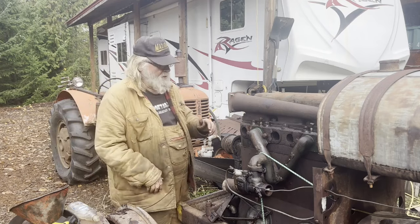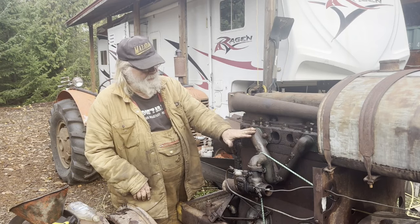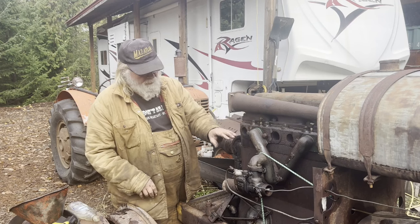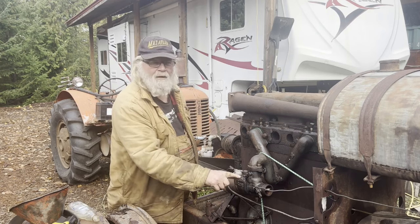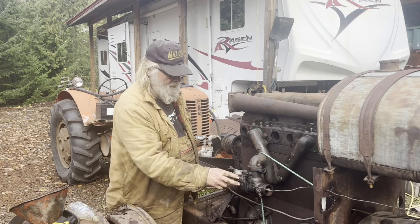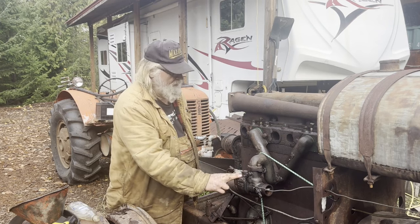Brake, that's pretty clear that we got fire in the hole. It'll run as long as I put the raw gas in through these ports. It did fire off as I choked it initially, but I think something's plugging up in the carburetor. Full choke, it doesn't want to fire anymore. So we're just going to take that off and clean that out.